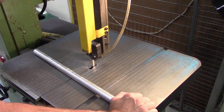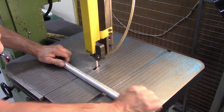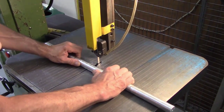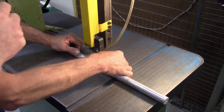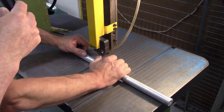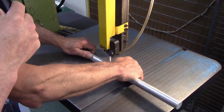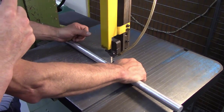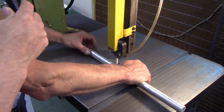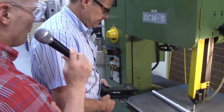Well, what will happen is you have this blade cutting in a downward motion. It'll actually turn the stock. And if you're up here like this and you're pushing it thinking nothing's going to happen, this can rotate. Once it starts to rotate, it'll suck your finger in. Now you can get your fingers underneath and pinch. Once it starts to pinch and it's pulling, as you can see, it's rolling up on my fingers and this thing's pulling down, I can have a severe pinch on my hands. All right? So there's just no good scenarios with pushing something by your own hand, is there, Don?